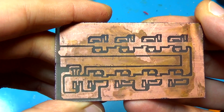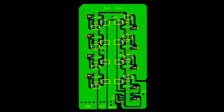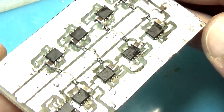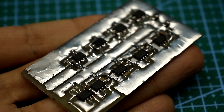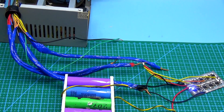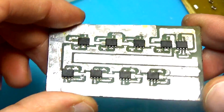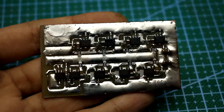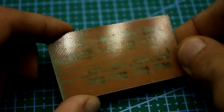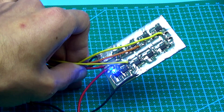Printed boards, as always, you can download via the link in the description along with the project archive — I pre-mirrored it, so you just have to print. There are quite a lot of jumpers on the board; it is better to use SMD jumpers, resistors with zero resistance. The TP4056 chips will heat up depending on the charge current and input voltage — they work in linear mode, and each chip dissipates about 1 Watt as heat. With 9 chips that's 9 Watts total, which is quite strong heating. The microcircuits are cooled by massive tinned tracks, although a double-sided board with copper coating on the second side as a radiator would be much better. But I hope the one-sided board will be enough — we will make heat measurements later.